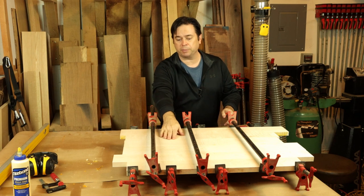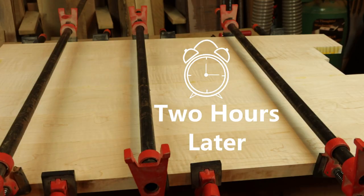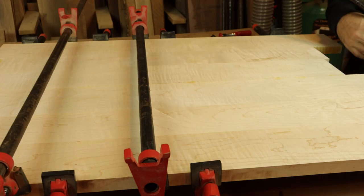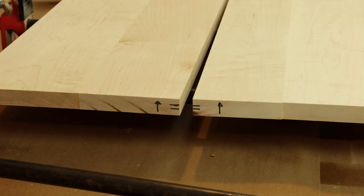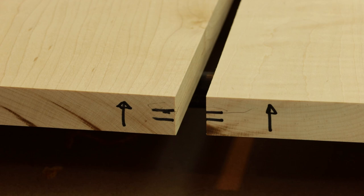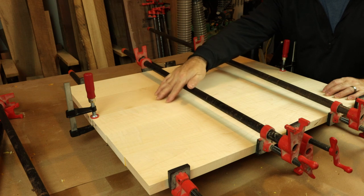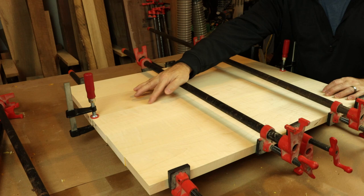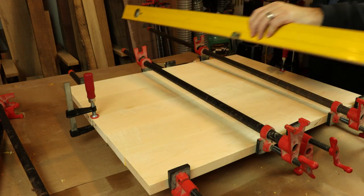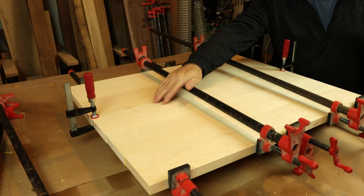That way, when these large panels come out of the clamps, we'll only have one central seam — a little bit of sanding should take care of that. That doesn't look too bad at all. It's useful to come up with some sort of labeling scheme. I've labeled each of the pairs of panels with either one, two, or three horizontal dashes, and then an arrow to indicate the top face. It's worth going through the trouble to dry-clamp these two panels together — make sure you're going to get a good flush edge. Tighten your clamps up loosely, then use a straight edge to double-check that the panel is sitting nice and flat. That looks really good, so we're ready for our final glue-up.